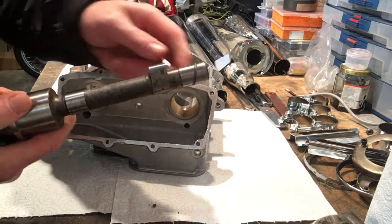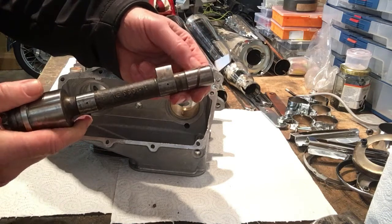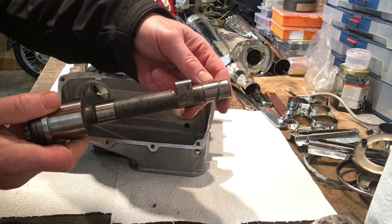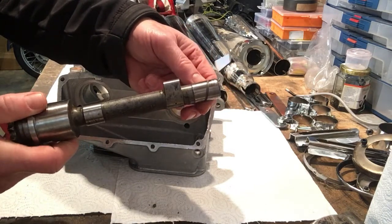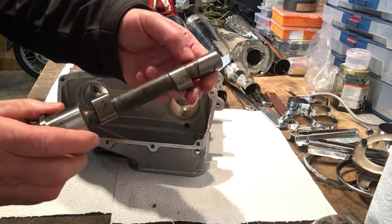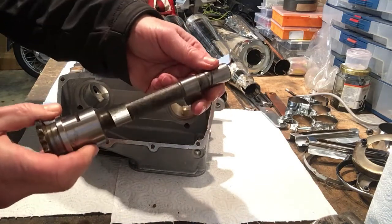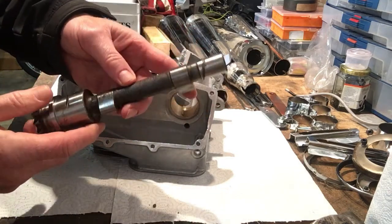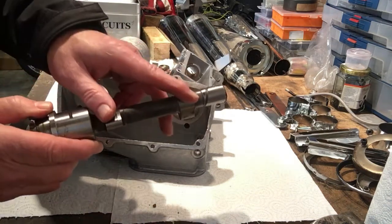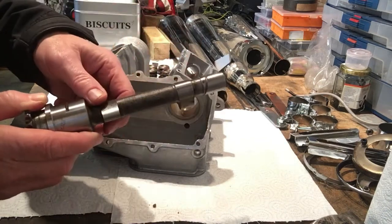And then at the far end, well, it wasn't a bearing originally, it was just going to be plain alloy in the head, for the cam bush at the far end, you can see that's got a diagonal groove in that to draw oil in. It's not actually pressure fed into that bushing. So that happens with both cams simultaneously, and then oil is sprayed out onto the lobes over the tappet